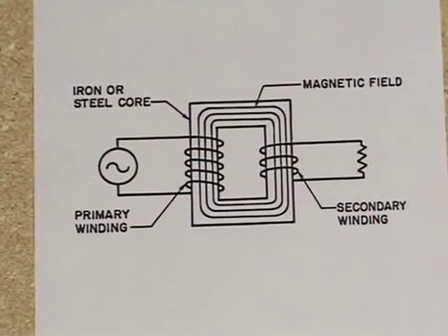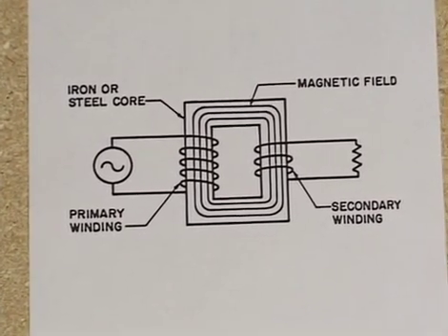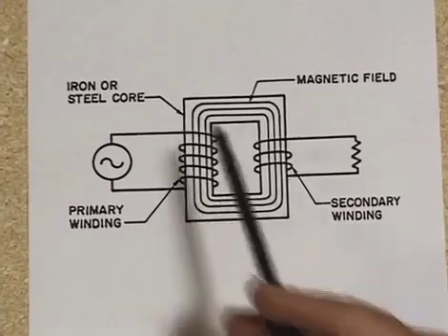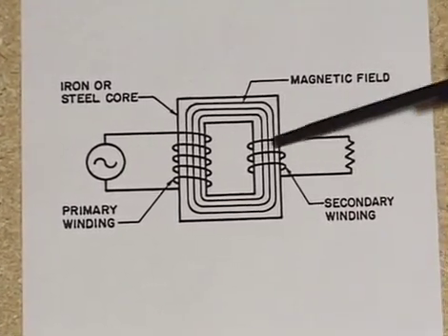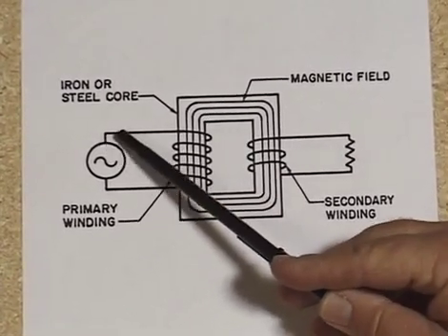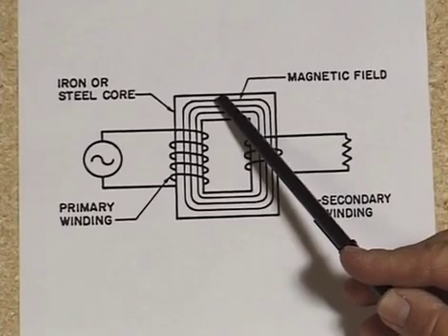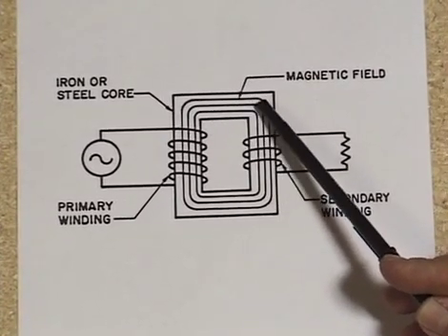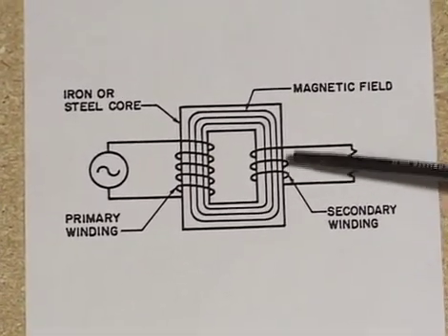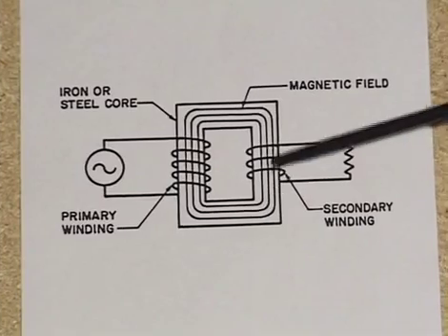Here is a simple pictorial illustration of why those meter tests worked as they should. We're showing you the primary winding — the generator — so that would be power going into the primary. The electromagnetic field that travels around the wire is going to be picked up by the iron or steel core plates, and that field will then travel around those plates until it gets picked up by the secondary winding. The primary winding has many more turns than the secondary winding.